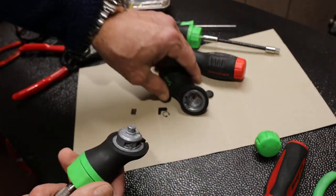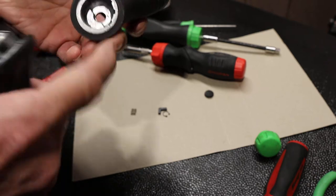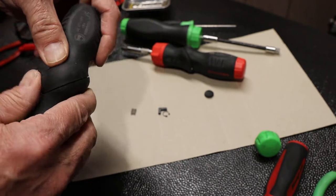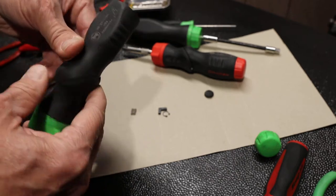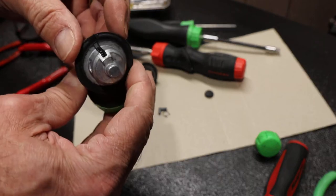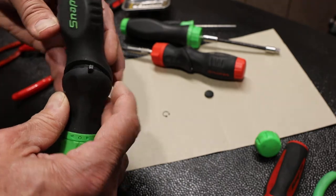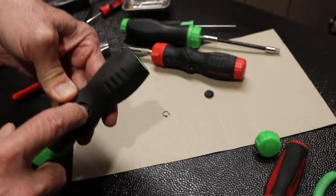The reason you need to be careful is there's a spring-loaded — not much of a spring, just a little tiny one — and this guy slides into a notch. Here's the lever, and that's it. When I put this together and feel the resistance, there's quite a bit, and I realized Snap-on essentially put the equivalent of a gasket right here — a little raised area of rubber. So there's no way to make it silky smooth, and that's probably on purpose; it gives it a nice resistive twist so it doesn't flop around. To put it together, drop that little spring down inside the notch, the long end of the L-shaped piece of metal goes sticking straight up, then align it, push it down to get it into one of the notches, and reattach the snap ring.